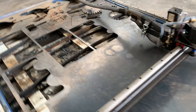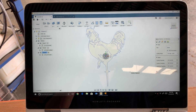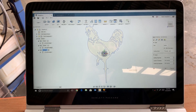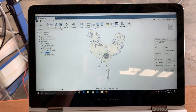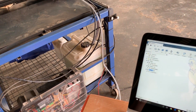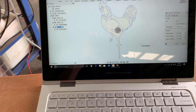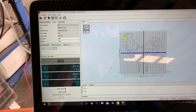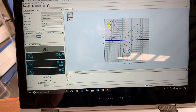I thought I'd fire it up and cut out a Christmas present. Once you've got it designed in Fusion 360 and given it a laser cutting tool path, you've got to process it. The post processor my brother actually customised for me so it talks nicely with the Arduino and the system I'm running — happy to share if anyone wants it. Then you export the G-Code, upload it into Universal G-Code Sender, make sure everything's calibrated, and you should be right to run.